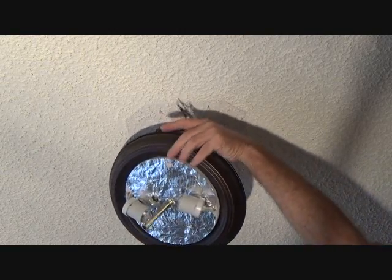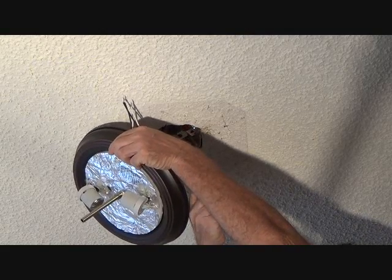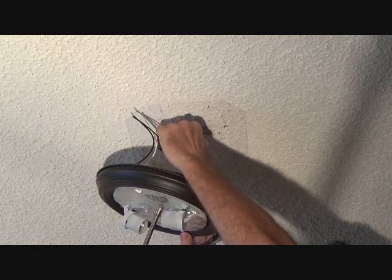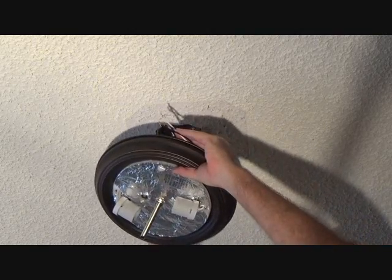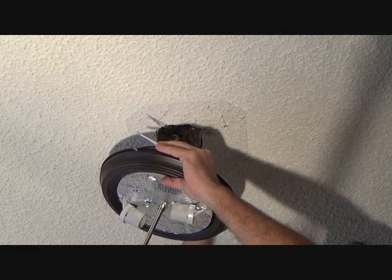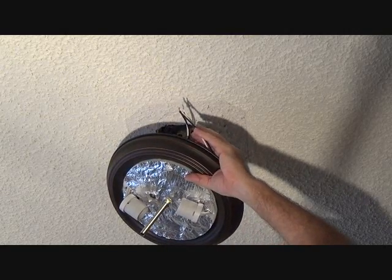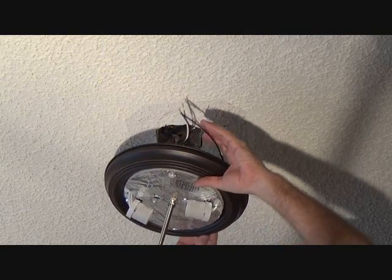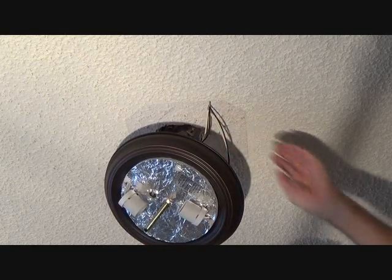And I've got to look at this and maybe bend the tip of that. This is pretty long here, and maybe I should cut that off. I think I have some cutters, because when you put the wire nut on, you want the wire nut to cover all the way up to the rubber that's still on the rest of your wire. Lucky for me, if that doesn't happen, I have the black electrical tape that I pulled off, but I'm hoping not to have to use that.